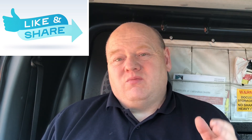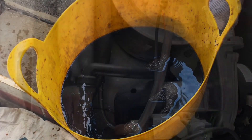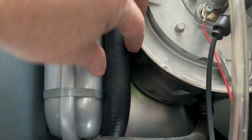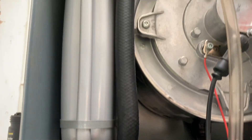What we're going to do now is take the plate heat exchanger out, take the hoses out, and flush this through. The biggest problem with these is muck in the heating system — installers not flushing them correctly when they're installed. If you're going to take a case off a boiler, you must be Gas Safe registered or competent to do so.